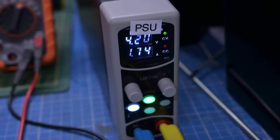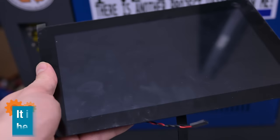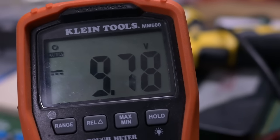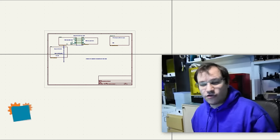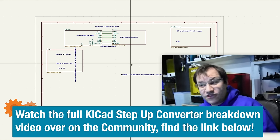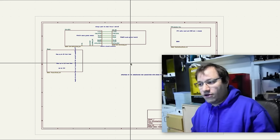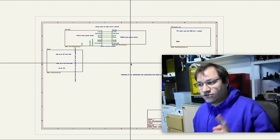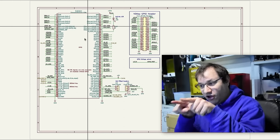Pretty complicated is it to design a step-up converter — I've never done that before. We need to make two designs: one to go from 3.7 (aka 4.2 volt) LiPo voltage up to 5 volts for the main CPU, and also up to 12 volts for the screen, or at least 9 volts since the screen works on 9 volts if we can supply enough current. Back in KiCAD, I'm using the form factor of the Compute Module 4 — or the upcoming Compute Module 5 — for my pseudo-SOM, which means it should be compatible with both. This sheet has the GPIO side, the high-speed side, and the FPC bus system. A laptop is a big thing.